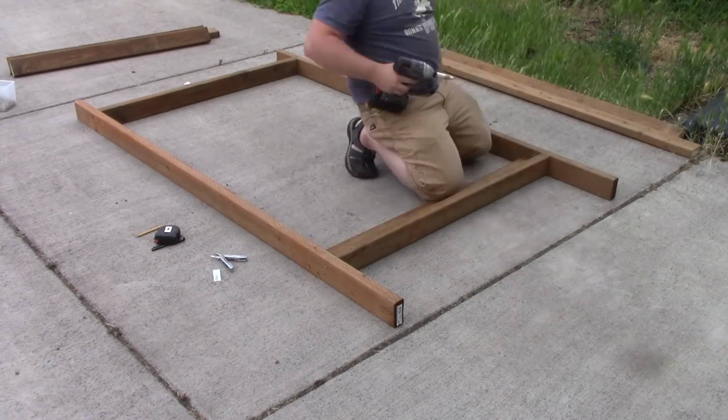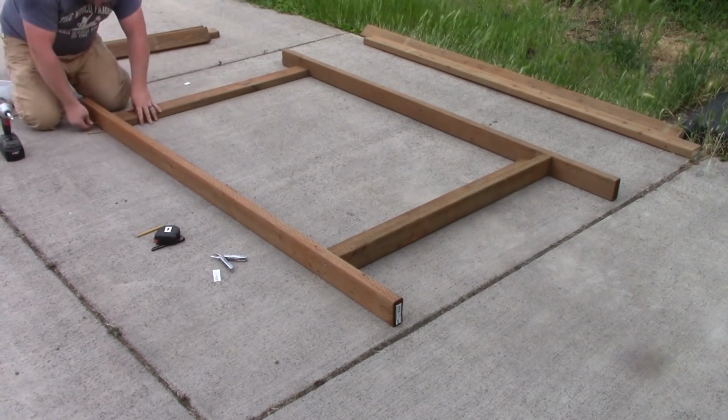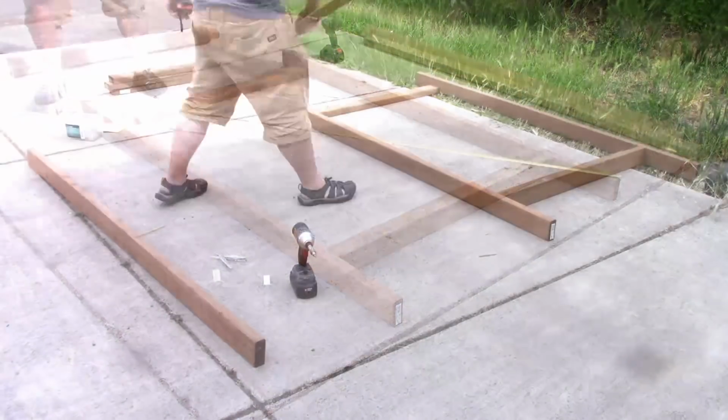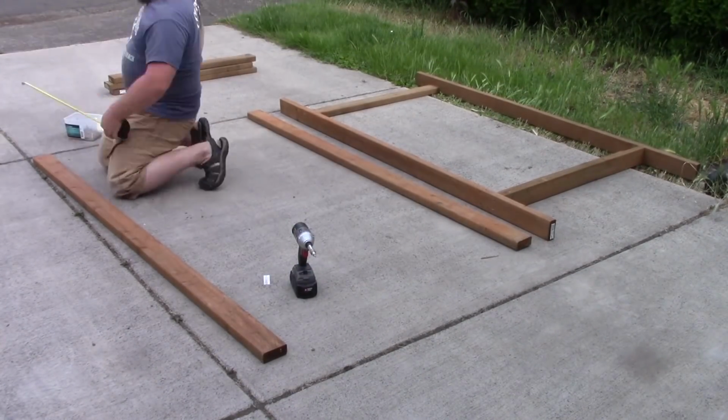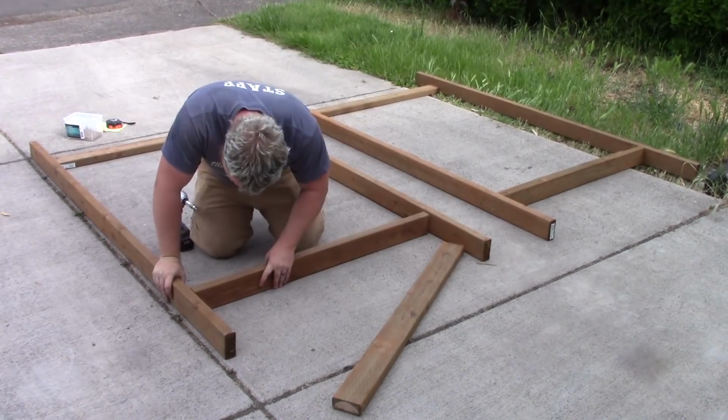You can see that in how I am putting this gate together. The bottom crossbar is 6 inches up from the bottom of the gate, and the upper crossbar is a foot from the top of the verticals. However, as I was putting it together, I initially had the bottom crossbar rotated the wrong way and had to redo it.